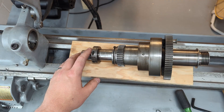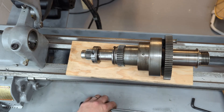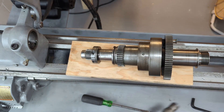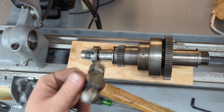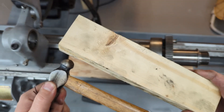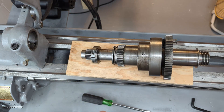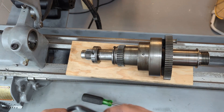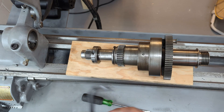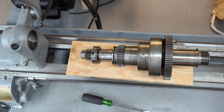To do this you're going to need just a couple of simple tools. You're going to need your slot screwdriver. You might need a hammer depending on how things are going — a light rubber mallet would be better. I don't have one so I do have a wood block to tap against if I need to, so I don't damage the spindle. And you'll need an Allen key, or whatever type of fastening you have at the top of your spindle or the headstock there for the spindle.